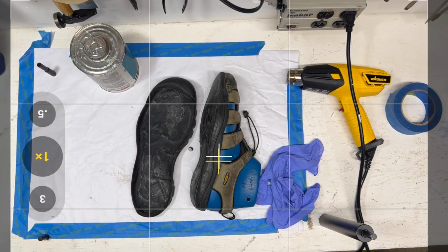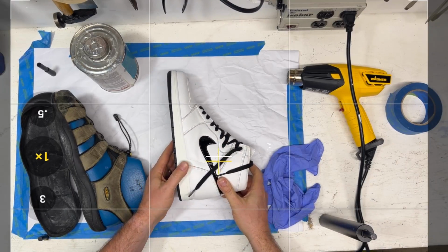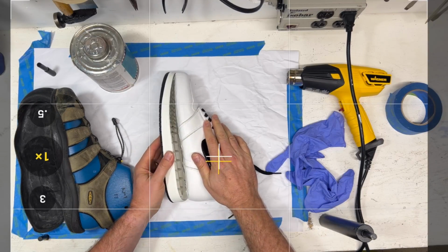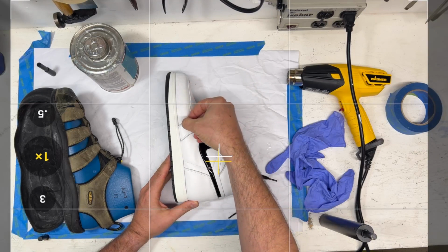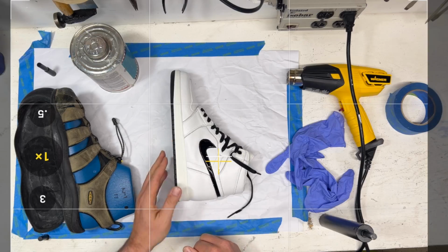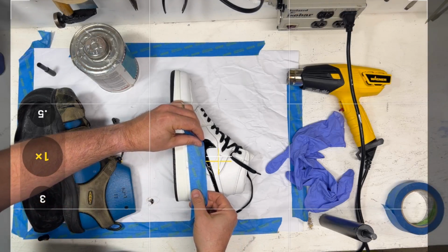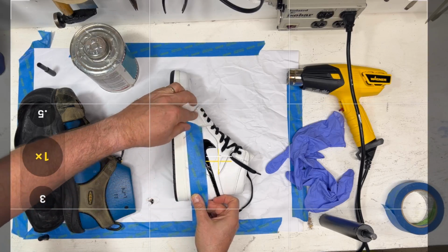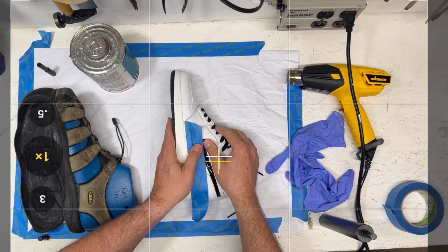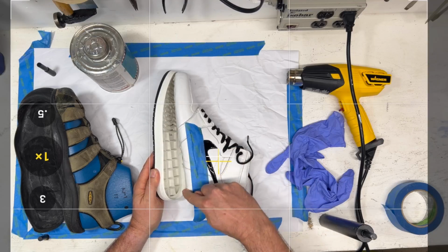So when you're in a factory, you're gonna want to see the same processes. Granted, usually we're doing something a lot more interesting and fun, but the principles are the same. In this case, this is outsole to upper, right? But what you see here is there's already a score line, a glue line. So for your project, you're going to want to mark it with a pencil. And if you put a lot of work into your upper, you're going to want to put a little tape line to keep glue off your upper, and just hold it back from that marking line just a millimeter or two, because you want to have a little bit of glue space there. So just get it pretty close, and if a little bit of glue gets up there, that's okay.